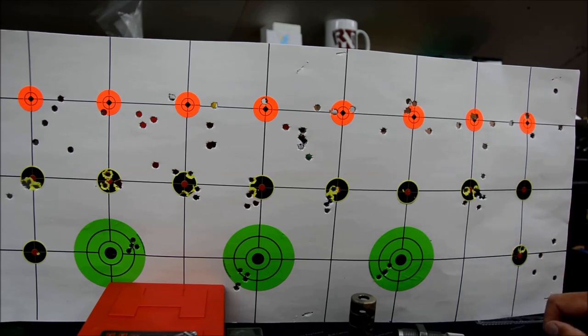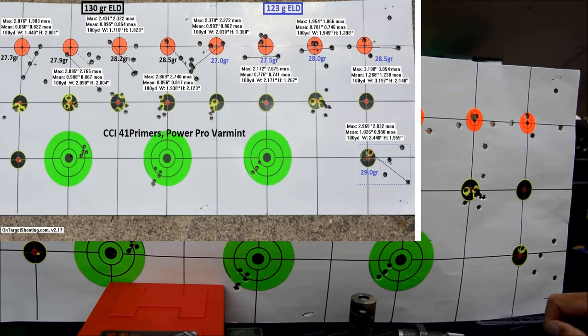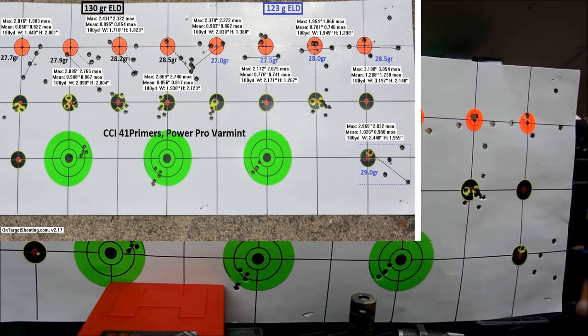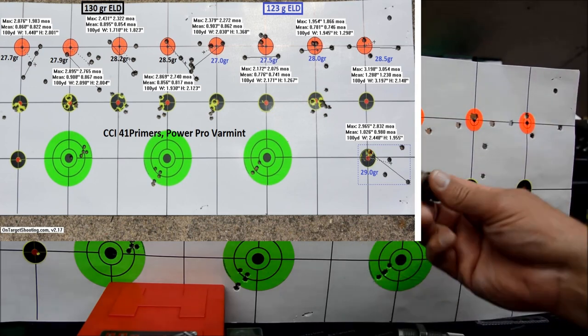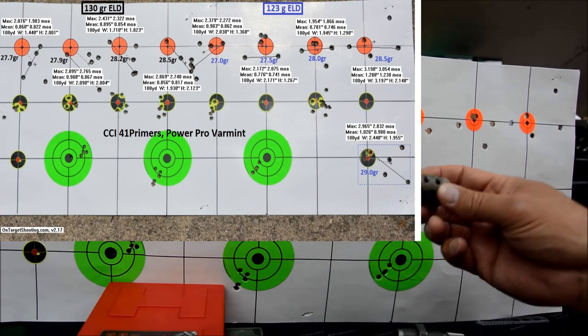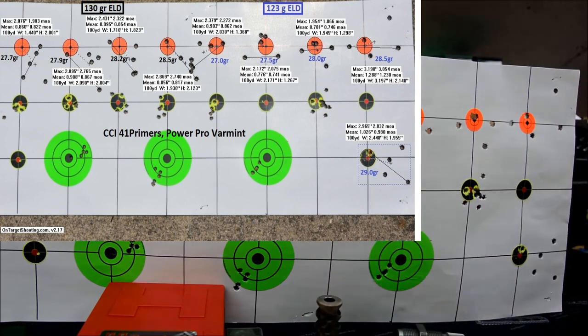The ammunition, I've gotten to really good levels, better than the factory ammunition of the Hornady Black. I mean, more consistent, should be more accurate, and yet even the Hornady Black is just scattering all over the place on this barrel. And that's after the bedding, the facing or truing of that receiver, honing of the front of the receiver, putting it all back together. And in this case, changing out the muzzle brake for a heavy tanker style muzzle brake, which is more than twice the weight of this one, just to try to change the harmonics.